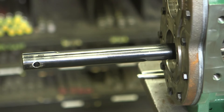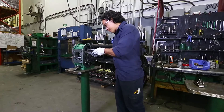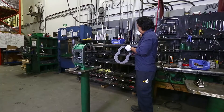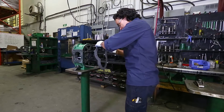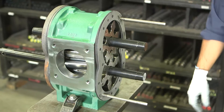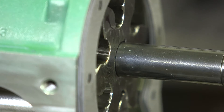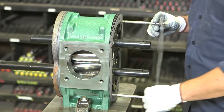It's important to make sure the extended portion of the drive shaft is facing the front of the pump. Now place a key into the idler shaft and insert into the idler gear. Then guide the two assembly pins into the rear of the center housing. You'll need to place housing gaskets next to the center housing. Depending on the gear material and condition of pump components, the number of gaskets required to reach optimal performance will vary. Start with five gaskets for helical steel gears or eight gaskets for Buna and rubber gears. With the gaskets in place, there should be less than ten one-thousandths of an inch of clearance behind the gears. Hold a straight edge against the gaskets and measure the gap between the straight edge and the gear, ensuring the gears do not touch the straight edge. Add or remove gaskets as necessary to achieve the correct clearance.